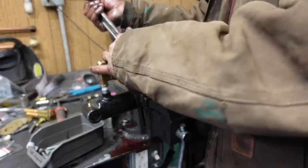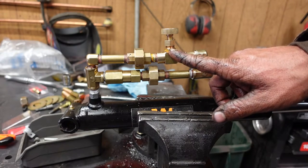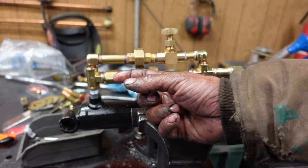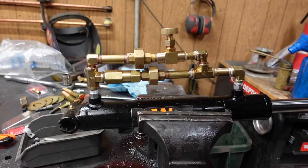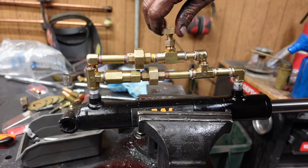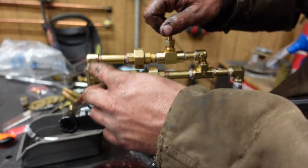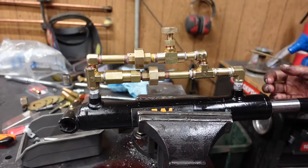Why does the union always leak? So here's my whole system explained: this is a check valve, this is a needle valve. In order for fluid to flow into the bottom part of the cylinder and extend it, it goes through this check valve that can only go one way — so the cylinder can always freely go up, allowing me to push the saw up. In order for it to go down, you crack this little needle valve to control the flow of fluid, since it can't go through the check valve it has to go through the needle valve — that's how we regulate how quickly the band saw goes up and down.